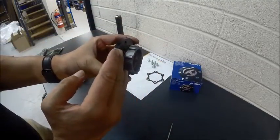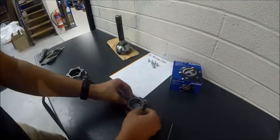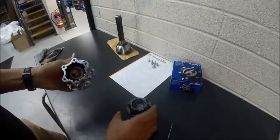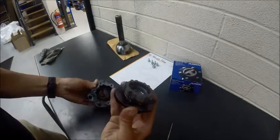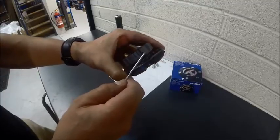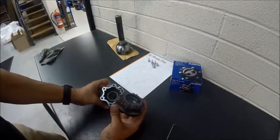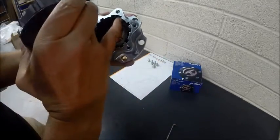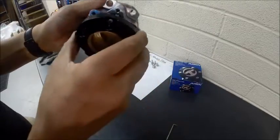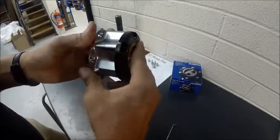Now we're ready to put the cap back onto the hub. New gasket on. Put a smear of LM grease — standard grease, not too much. The important thing is that this little tab is now in between those keys at the top and bottom, and it must locate into the hub's master cutout. Simply push in, hub fully against the main casting, and that is assembled.